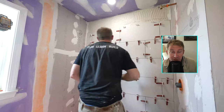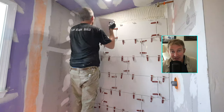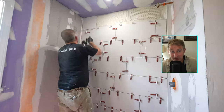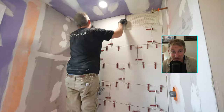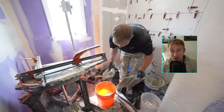And then same thing for your ceilings, just make sure that you provide a little bit of a gap at that top of that ceiling. And that's really, really helpful because when we use the siliconized acrylic caulk that we'll be using to basically caulk that entire top joint, if it has a little bit of a groove for it to go into, it'll be a much stronger joint and last a lot longer.